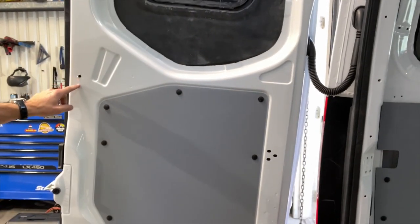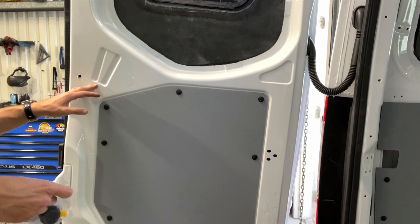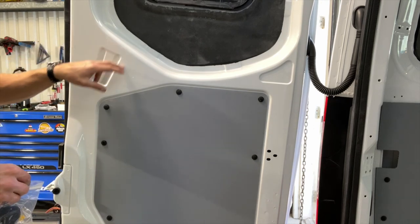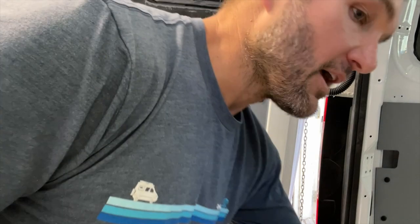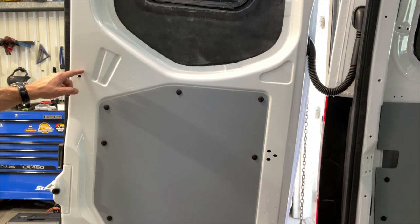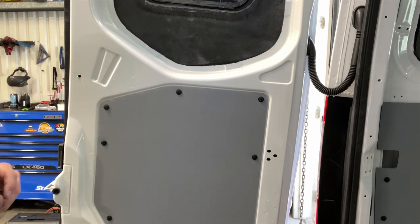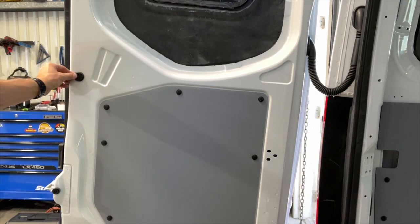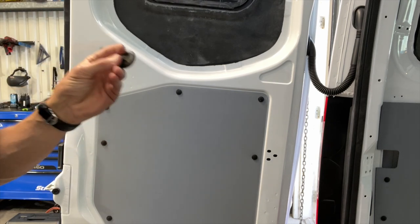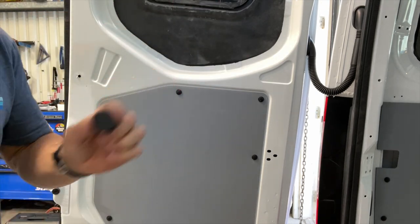You can see I came all the way through here. Now, if you have the cutout, you do not need to drill through your door — that's important. Do not drill all the way through if you have the cutout, because the only purpose for drilling through is to access the nut on the backside of that bolt. If you have the cutout, don't drill through — you have a giant opening right there and can easily access it. This little cap will eventually go in there and it blends quite nicely. You will not need this cap if you have one of those openings and a panel that covers all this.